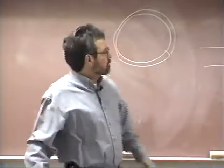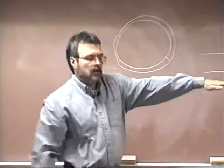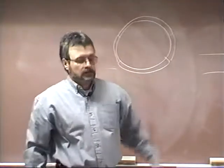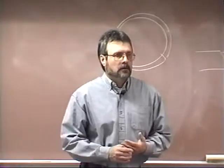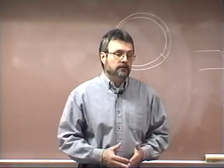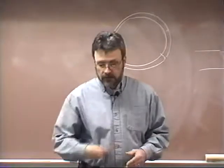So you got to remember now, we're talking about horizontal fixed, vertical down position. So you can use a little weave without any problems. Vertical down weave is a very common technique. Depending on how wide it is, you may have to do stringer beads or multiple weave to cover the entire joint, but something like the Schedule 40 pipe, that's not a problem using a single weave.